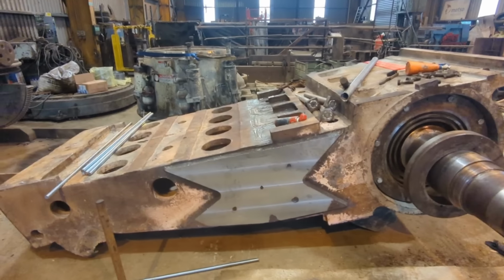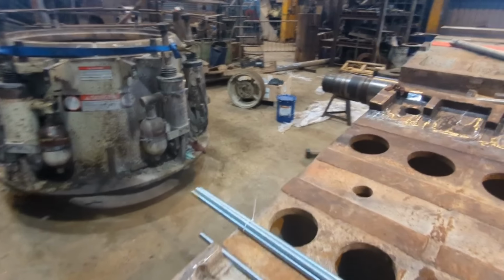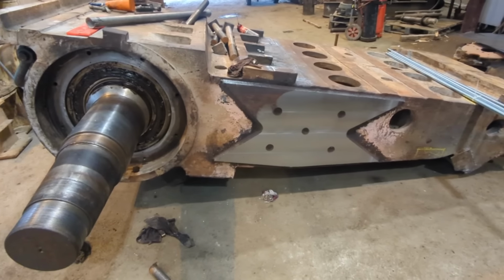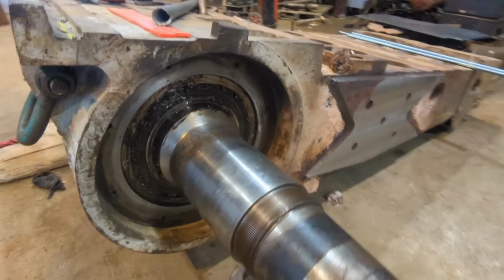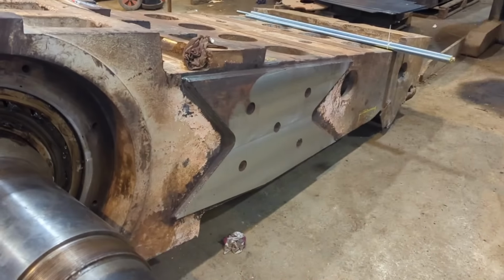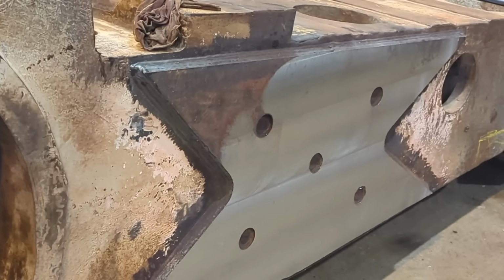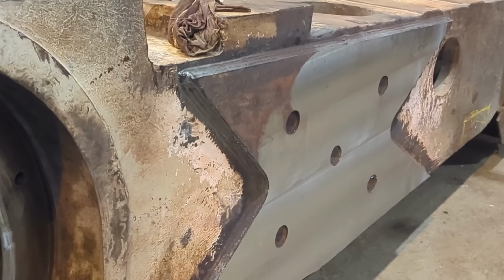So absolutely incredible phenomenon with these side plates. As you can see, they've been machined. So I calculated those side plates to give 5mm clearance per side, and seam welded them around the complete perimeter. And what I did not foresee or allow for was the absolute minuscule air gap that was behind that plate to expand enough at 600 degrees to bulge all of those areas out like a balloon. If you imagine like blowing glass.